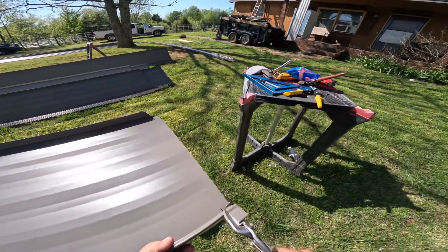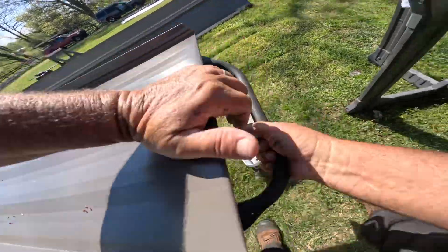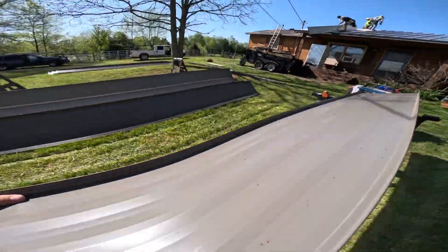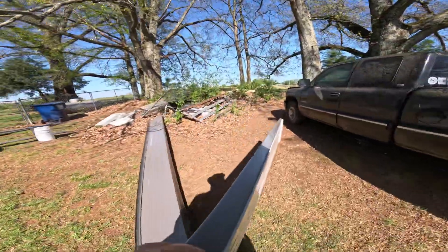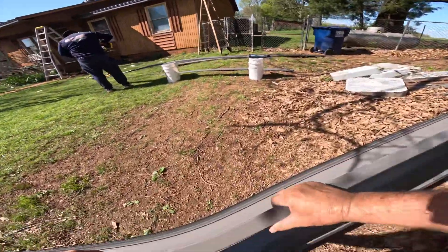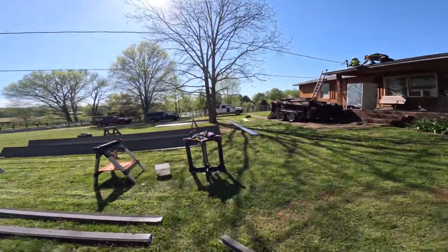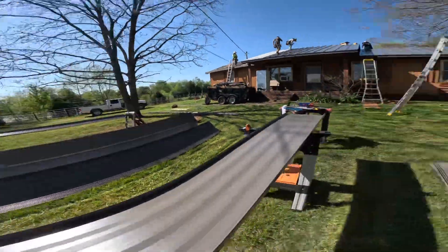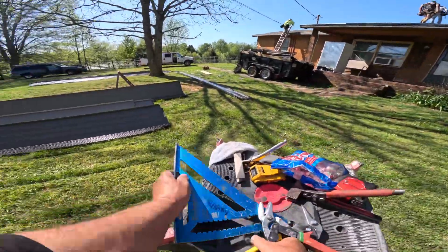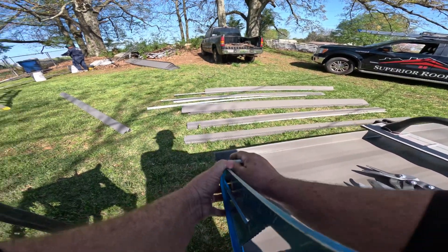This will go in the other direction. This has to be done with a right-handed pair and then a left-handed pair, otherwise the snips won't cut up and over the rib. If I'm cutting from the other side — if I'm cutting on the left side I can actually use a right-handed pair of snips to cut up and over.